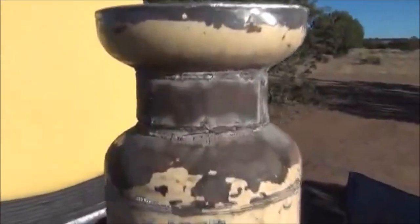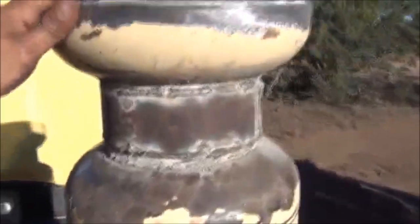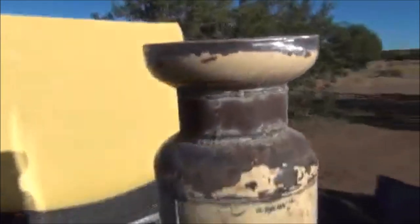The next step is to go ahead and attach our screen up here. Let me fold this over so you can see what's inside. You'll notice there's one little offset hole from the propane tank lid right here — I'm gonna have to cover that with a piece of steel; I don't want to leave an air gap like that, as that'll be an off-pressure area. You'll notice in here that this actually reduces again — you can see how far underneath my fingers are sticking. That's another reduction point. This hole right here is actually smaller than the inside diameter of our other reduction point, so it's a finalized reduction point before it goes into the ash container. This should guarantee a pretty good burn and a clean gas out of the end.